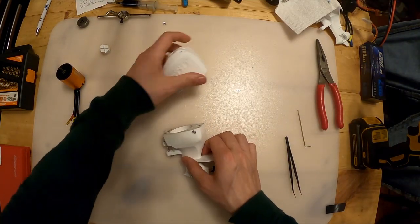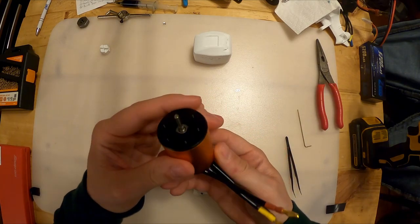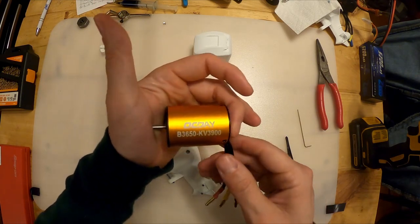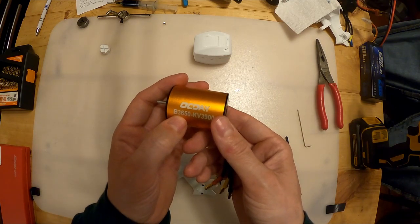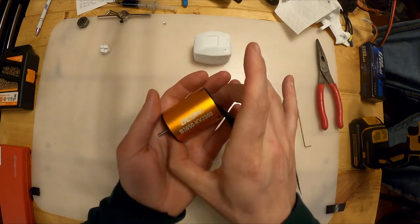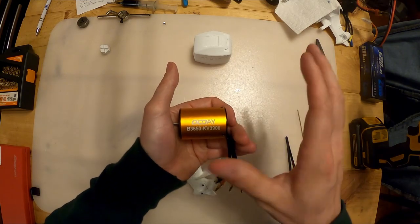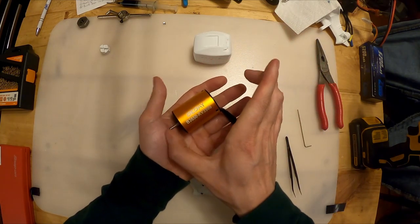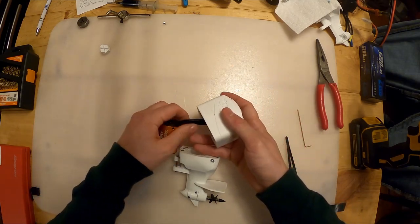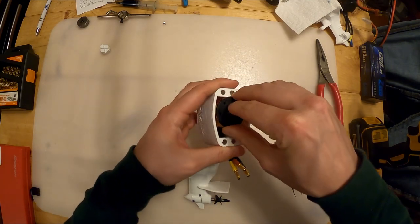All right, let's get to the next part of this, the motor. These are El Cheapo, super cheap, almost disposable, kind of, not really. I get them off AliExpress or eBay or Amazon. I'll put a link in the description. This is a 3650 size motor, so it's 36 millimeters in diameter and 50 millimeters long. I've seen some variations on this. It's got to be a 36 millimeter diameter, but maybe a 40, 52, or 48 millimeter length would work. I think that's fine, as long as it fits under the cowl. When the wires go through the front here, you have to be able to fit this all up inside.